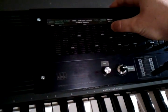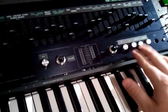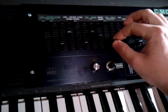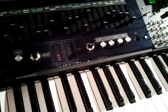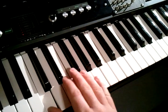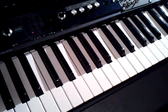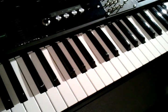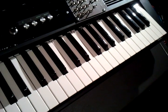I then send the sound into a 4040 divider and take a bunch of the top outputs and just mix them together. It can create some pretty cool sounds, especially if I have both sets of oscillators on at the same time — kind of reminds me of chiptune chords. Especially when you get up to the higher notes — that's just holding one key. There are some really interesting options as you start to add more notes in different keys. Hitting the same note creates a nice rhythm; hitting odd notes in between can just create noise, which can be desirable, especially for a drum beat.